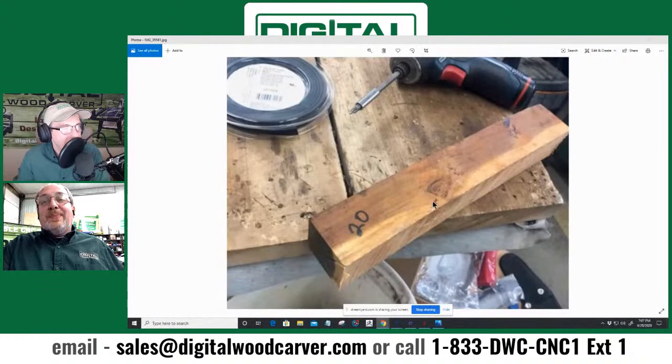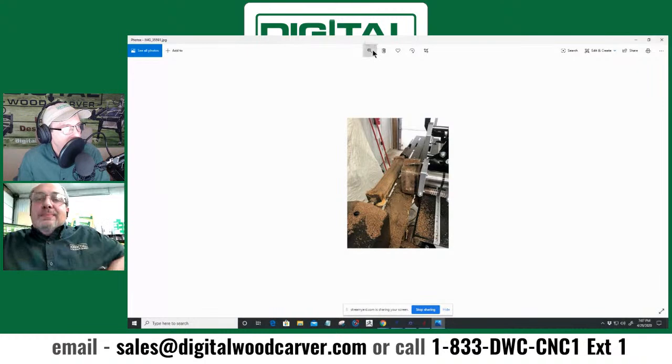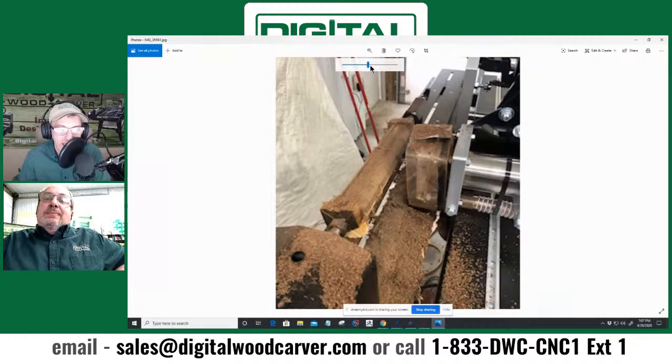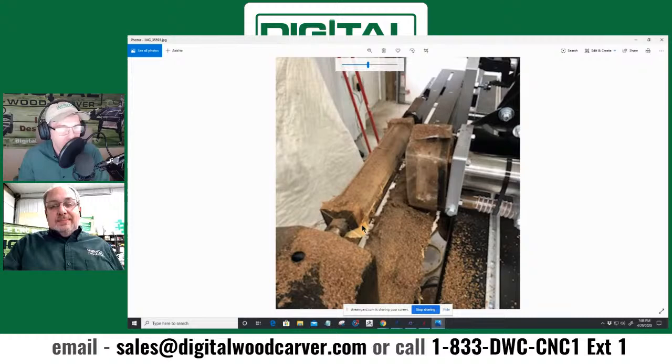Absolutely. Once we got it on the table, we went through the rounding tool path, and I've got to zoom in and out on the images as we go through. On the rounding tool path, let's bring that up close. This is where it takes our square block and knocks off the four corners, and then it trues the piece up to round to whatever diameter we dictate in the software. And this is a picture, and when you're on the fourth axis, there's some sawdust to be had. It's just like being on a lathe. There's some piles that Burl's got right there on his bench.